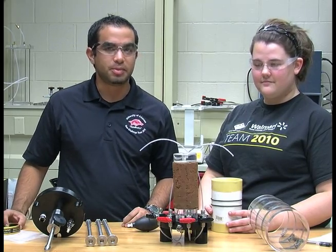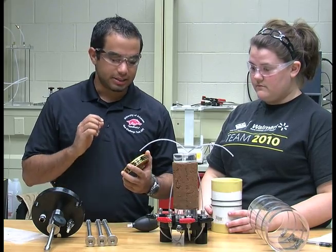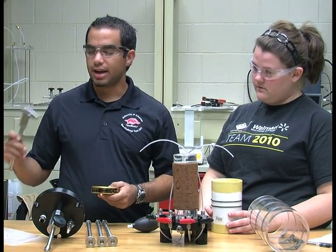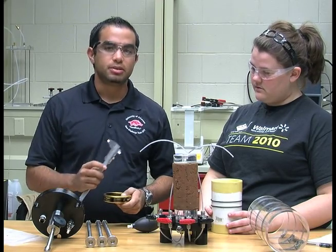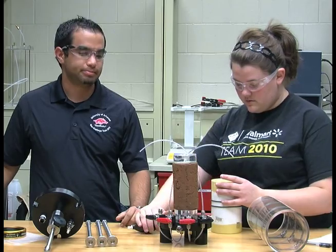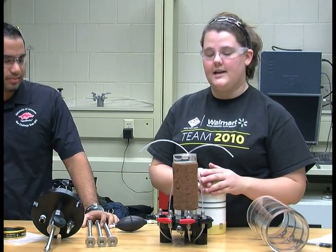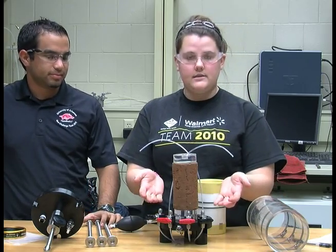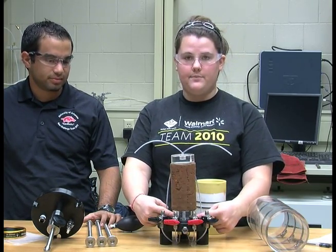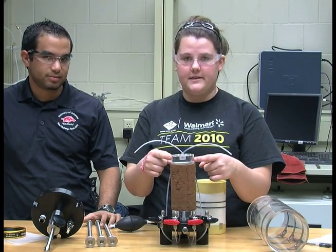After acquiring all the materials and the sample is ready, the sample was measured using a pi tape for the diameter and a caliper for the height to confirm that the slenderness ratio was 2 to 1. After measuring the height and diameter, the sample was then placed on the base, which has a bottom platen, which is what the sample is sitting on, and then a top platen is placed over the sample.